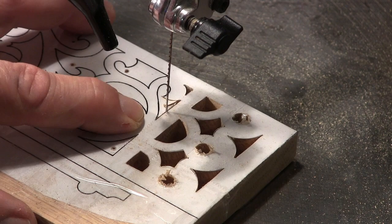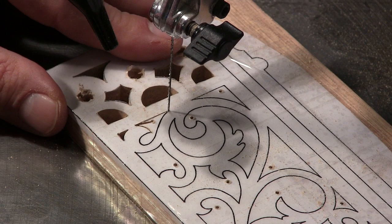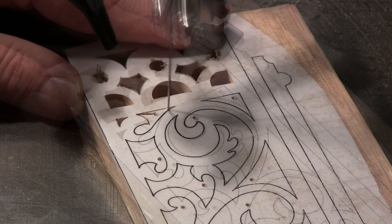Now kind of like that first cut I showed you, there's another tight V cut. What I've done is come all the way to the line, now I'm going to spin it out, bring it back to a waste area that's open, turn it around, back it in, and now I can just angle the piece, start it up, let it find the line, and then take off in this new direction.